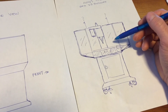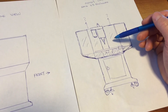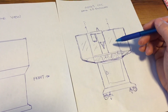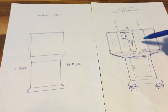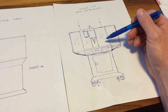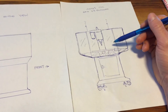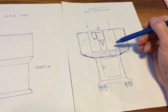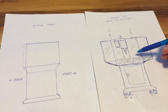The reason I'm thinking polycarbonate is not only that it's stronger, but it's easier to machine and drill. You can cut it with a saw very easily and drill through it easily — it's soft and easy to tool. That's why I want polycarbonate versus acrylic. Polycarbonate is the actual name for what people refer to as Lexan — Lexan is the brand name, and polycarbonate is the material.